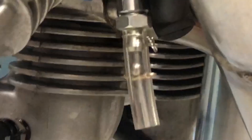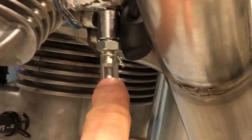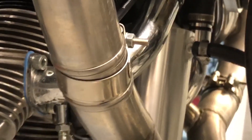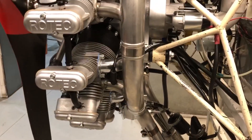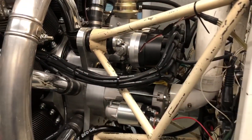Also on the intake pipes here, I've got these little ball drains — they'll actually go with the engine. If people want to improve on that design or use metal ones they can, but I can't see any reason why you wouldn't. There's enough distance below the pipe if you attach a nipple and route it away. There's a little five-millimeter ball in there that sucks up when the engine runs and drops down when it shuts down, so it automatically drains those intake pipes — same on the other side. There are three of those in total. We don't put the wing nuts on anymore because customers tend to forget, and if you forget to drain those intake pipes it can be fatal — conrod bending, which is pretty standard on radial engines.